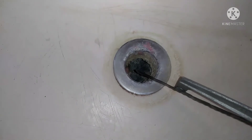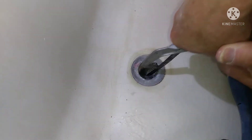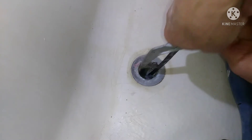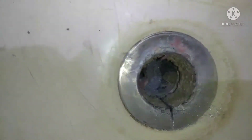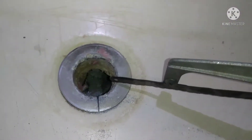I'm going to cut through this ring. You're going to have to cut down inside the pipe too, to make sure you get the threads. But when you cut the lip, you don't want to go crazy and cut into the fiberglass. Or if you have a porcelain cast iron tub, you might want to put some tape or rag there. Just be real careful. I got almost all the way through the lip part and almost all the way through the thread part. Taking my time, trying to be real careful, I'm going to leave just the tiniest little bit there so I don't slip and cut into the fiberglass.